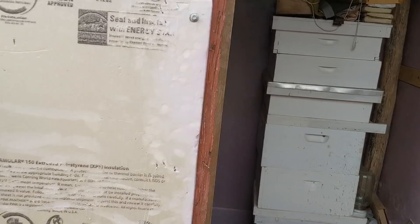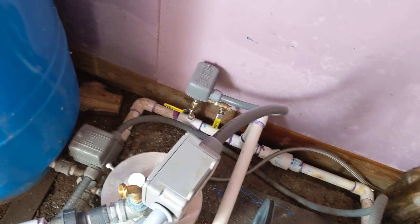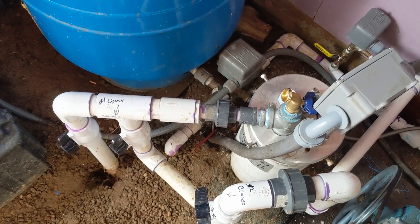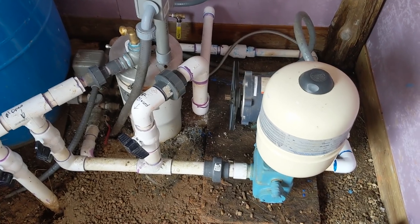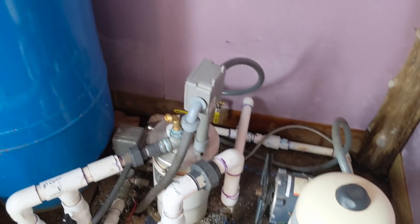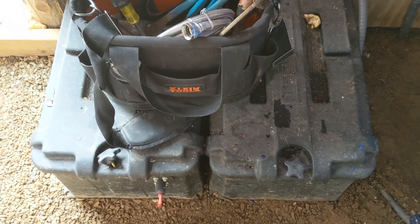Abraham's getting ready to help me put the simple pump back in. Here's an added pressure switch for the Grundfos for backup in case the piston pump ever goes down. This gives them a quick way to use the pump to pressurize the bladder tank instead of filling the cisterns, which it does every day to an overflow. This has been running for six years and probably needs a rebuild — so while you're rebuilding your Dankoff pump you can run off the Grundfos solar and electric. The flex charge shows a red light meaning it's diverting — battery's full — and we're getting twice the amperage into this 24-volt battery bank.